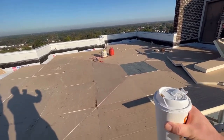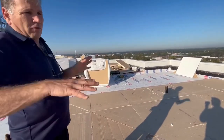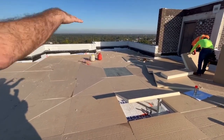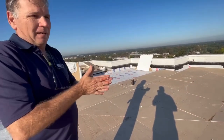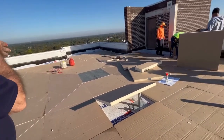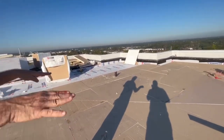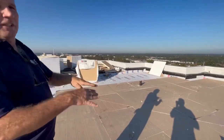The four-way system is the harder configuration, but this roof has drains set so it tapers in a couple different directions toward the middle. As long as you start from the drain with a four-by-four and line up your panels around it, it squares up nice, then you figure out where your hips and valleys stop so everything matches up flush. You end up with a continuous slope going to all the drains.